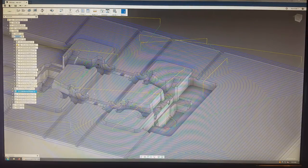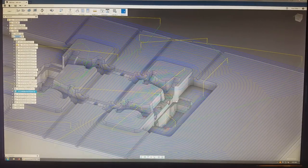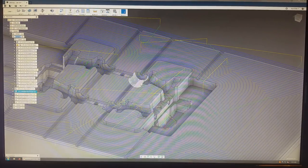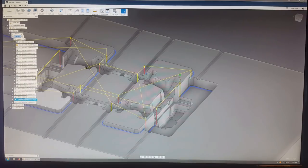And I left some material on all the other parts of the mold that weren't the actual piece. So that way when I sandblasted it, I only sandblasted the actual cavity of the part. And then I came back and cleaned all that up. So in theory, it would fit nicer together with the other half of the mold. Like smooth machined part on machined part instead of sandblasted parts on each other, you know?